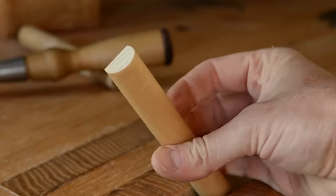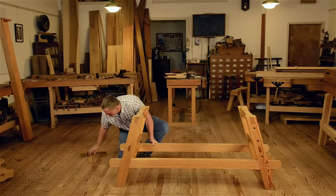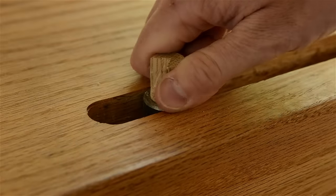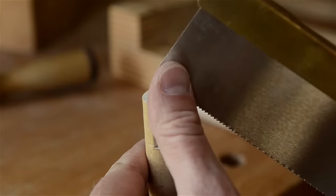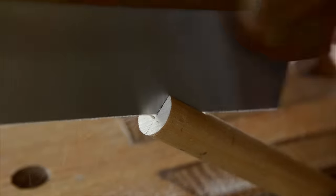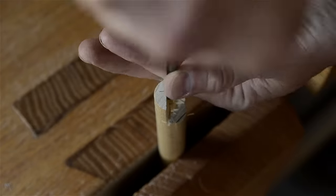There's no reason to spend too much time on this because it's just a bench dog and not a piece of furniture. I've got a couple of custom bench dog tricks that I learned from my friend Will Myers when we made the video together on building the Moravian workbench. The first trick is to add a triangular notch on the other end of the bench dog for times when you have an odd shaped piece of wood to hold down. I lay out a triangle on top, use a dovetail saw to cut at an angle along the top lines and sides of the dowel, then use a small chisel to remove the waste and clean up the dowel.